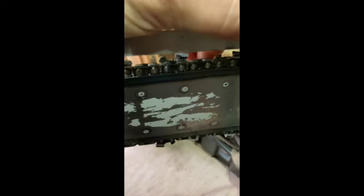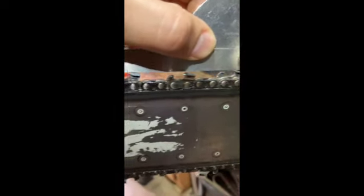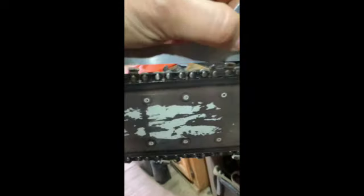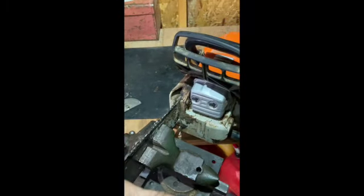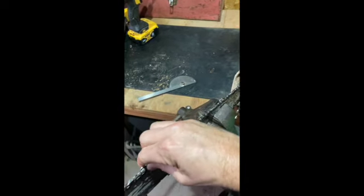We're back to that white tooth again. We've got a straight edge on here from that tooth to that tooth — they're on the same plane, same side. You've got your lefts and your rights. With some gap in there between the raker and tooth, we're going to be cutting, so we're looking good. We want evenly sharpened teeth and evenly brought-down rakers. One thing I forgot to mention: always when sharpening a chainsaw, make sure your chain brake is on, because otherwise the chain can move forward on you while you're sharpening.